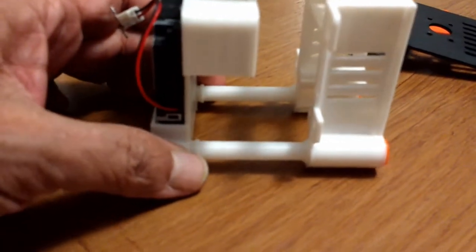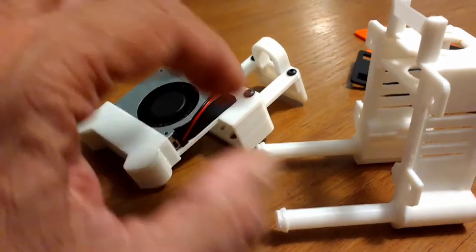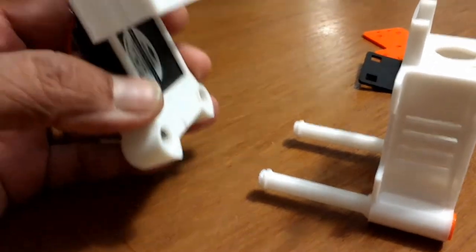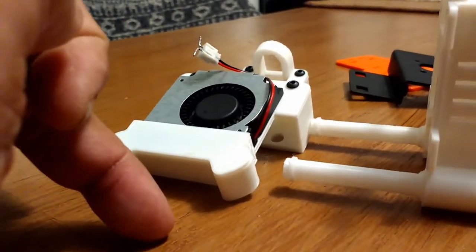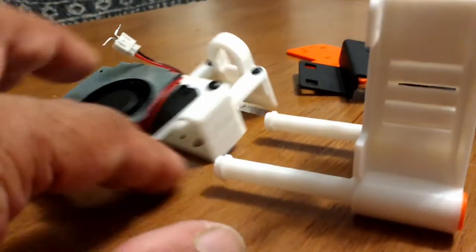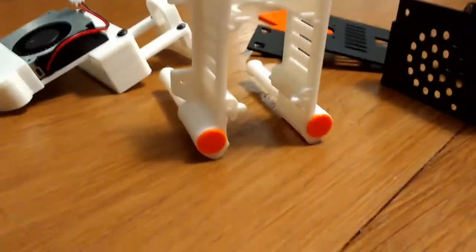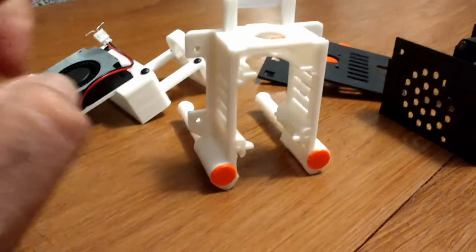The fan at the rear connects via these circular ducts. I was actually able to improve the efficiency of this fan by about 300%. The reason I say that is because on the original, the fan has a little metal duct with a little scoop, and that slot where air flows is very small and minimalistic — in my opinion it does not have enough airflow to the part. I have not tested this particular one yet, but my earlier ones are already running on some of my machines and they're working just fine.